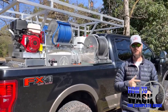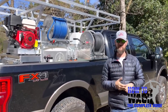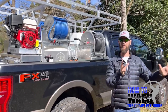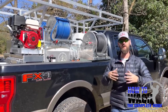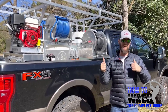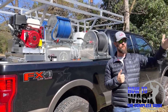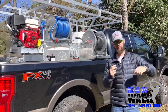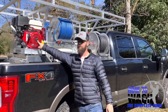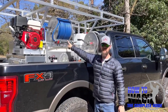One thing I didn't mention earlier: we always rinse metal roofs. A lot of times we don't rinse shingled roofs unless landscaping or lack of gutters tells us we need to, but on a metal roof we're absolutely going to rinse every one of them. Metal and bleach don't go together — bleach is corrosive. Not only the roof itself, but you've also got all those screws holding it down and all the rubber grommets. We'll rinse with the pressure washer — you could also use the soft wash system set to water only.